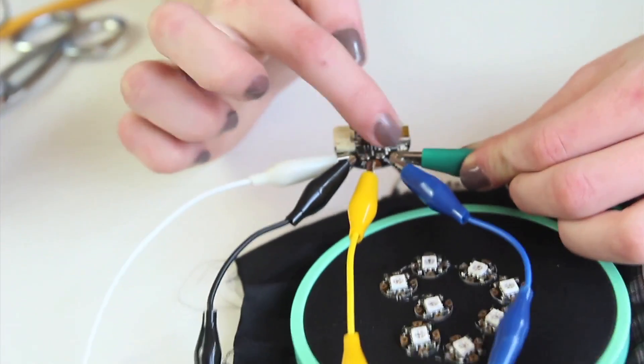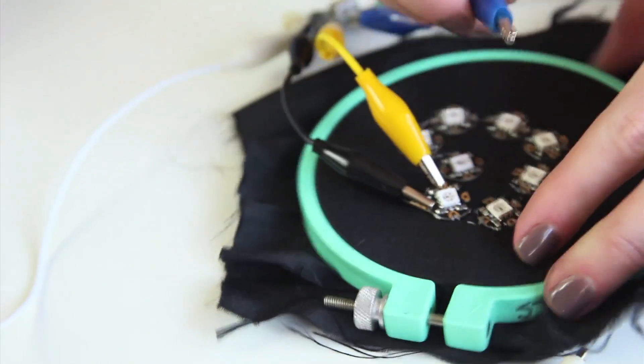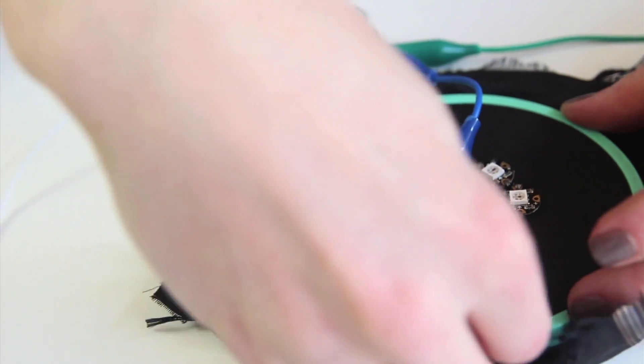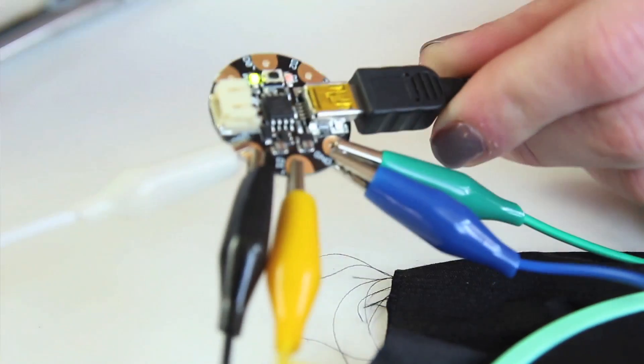But before we sew, Gemma has ground, power, and data. The data will go into the inward-facing arrow right there, power will go to the little plus, and ground will go to the little minus. So Gemma is the microcontroller we're going to use — it's a very small sewable microcontroller that we make here at Adafruit. What it does is hold a little program that we'll write in software called Arduino, which is all open source and you can read all about it online. I'm going to plug in this USB cable to load the program onto the Gemma, and it'll also provide power to our LEDs so we can see if the data connections we just sewed work.